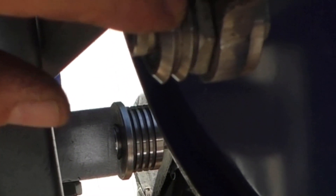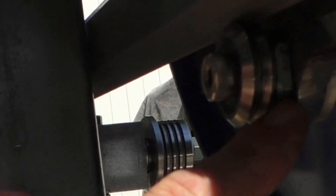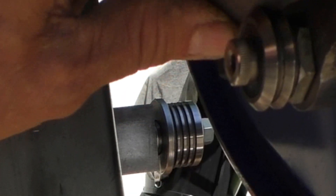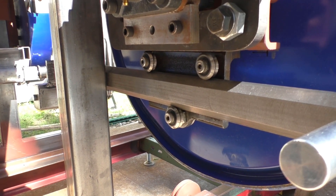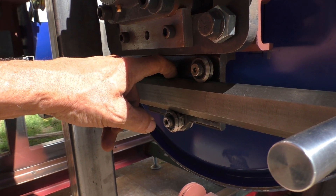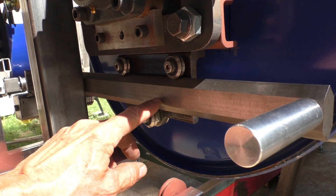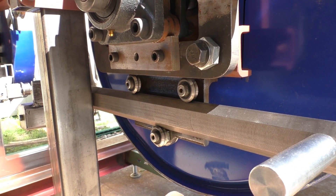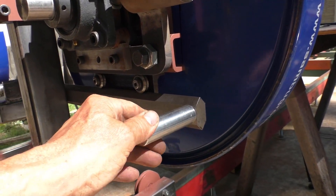There's a cap screw cut off so it's less than the thickness of the 3/8 plate. I flattened off the top and drilled a hole off-center — that's what the shoulder bolt goes into. When you rotate this nut head it travels in an orbital pattern, so you can tighten it up against the bar. That lets you set whatever amount of tension you want. I'll also be adding a ball bearing and spring assembly to the back side so it presses against dimples in the bar — the other side will have a series of holes, and the ball bearing will stop into each dimple to hold position. The handle is just a piece of aluminum bolted onto the end.